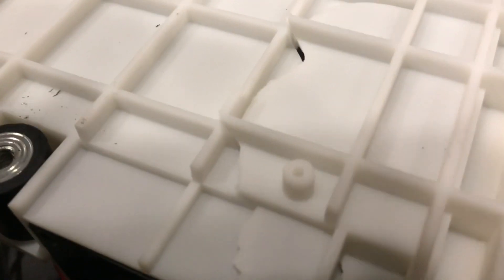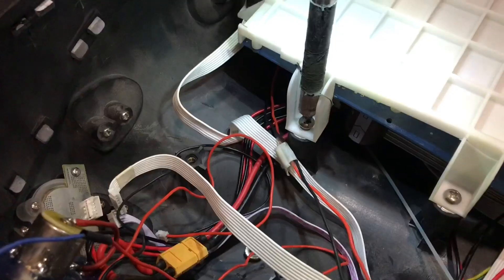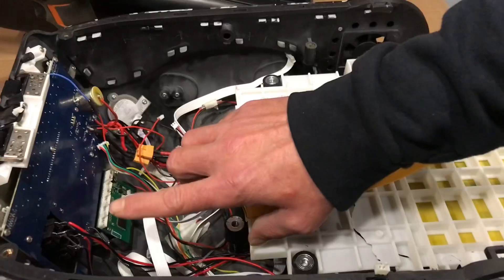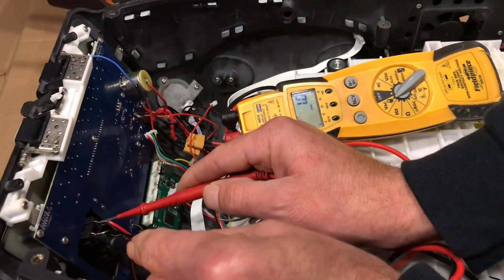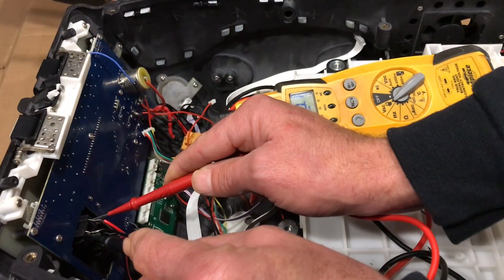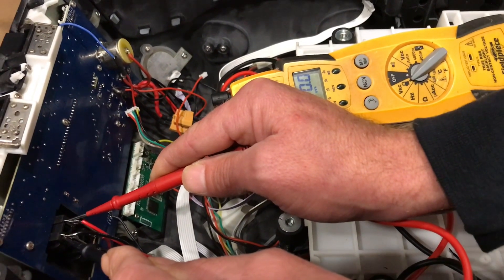Here's some of the shipping damage around the inverter casing, and the plastic up here in the front is already just snapped off. However they packaged this for shipment, it's not too good. There are the 120 volt leads right there. I'm going to check with a non-contact tester first and then put the actual meter probes on — checking to make sure no 110 or 120 volts is hot anywhere besides in the inverter. It looks to be safe, so I've got to blank off the high voltage leads now.